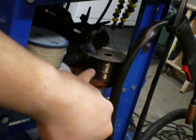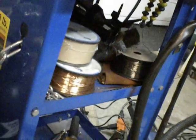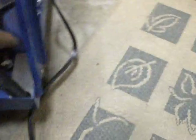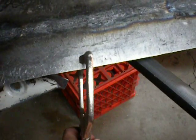For example, I used the flux core to weld a buddy's bracket on his truck. You're going to want a bunch of magnets to hold stuff in place, and you're going to want a bunch of various sizes of vise grips. These are special large-mouth vise grips. You're going to want two, three, or four of them, because if you're welding on the edge of sheet metal you want to hold it together all down the edge and you need some big clearances.